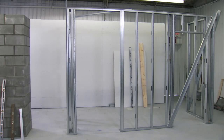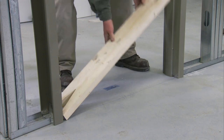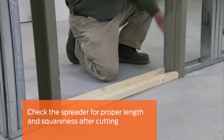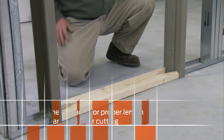At this point, the steel studs will be in place, leaving out the studs around the rough opening. Stand the frame up in the wall line at the proposed location. Using a proper size spreader, place it between the hinge and strike jambs at the floor. The spreaders must be cut squarely and accurately — this will help in aligning the jambs as they are anchored to the floor. This is very critical.